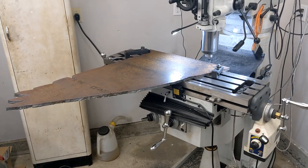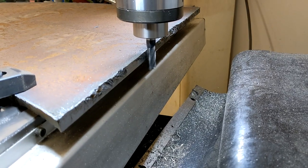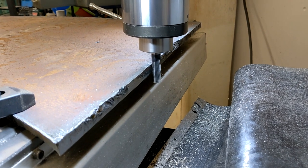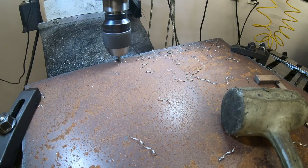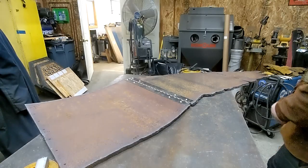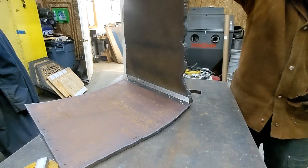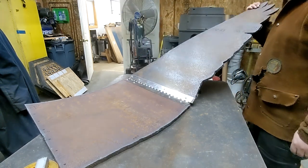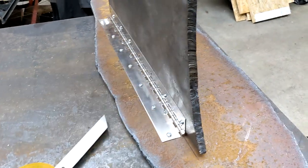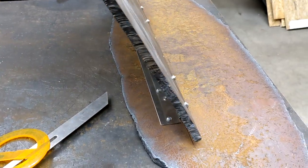I did want to clean up the hinged edges of the wing segments, however. This would provide a good datum against which the holes and other features could be positioned. I did this on the mill to provide a truly straight edge, and then drilled the series of mounting holes. The segments would be connected with a heavy duty stainless steel piano hinge, most of which would be hidden on the top side of the wings. The connection to the bird body itself was done the same way, except here there was a hinge being bolted to both sides through the same holes.